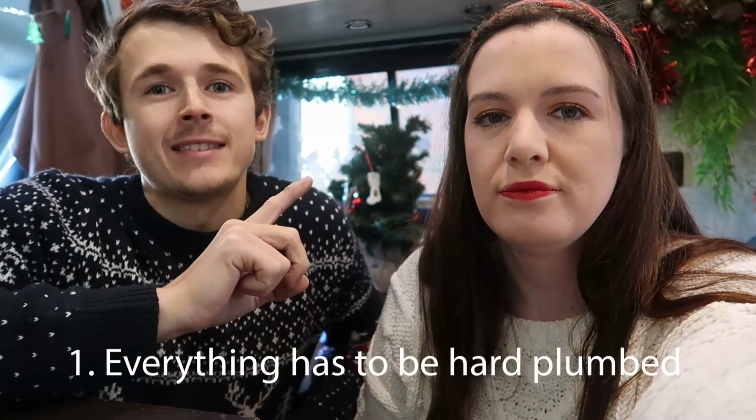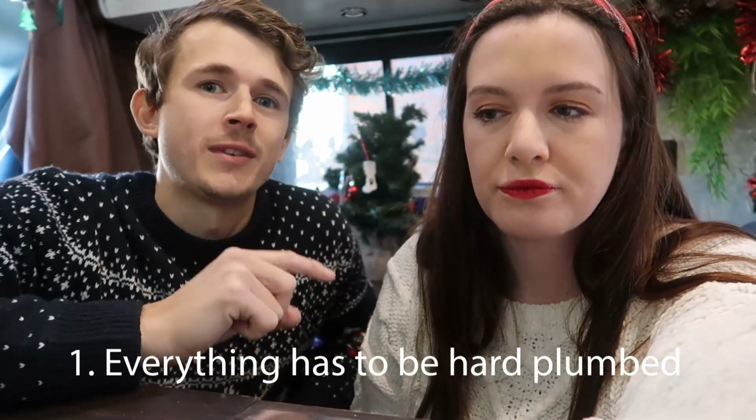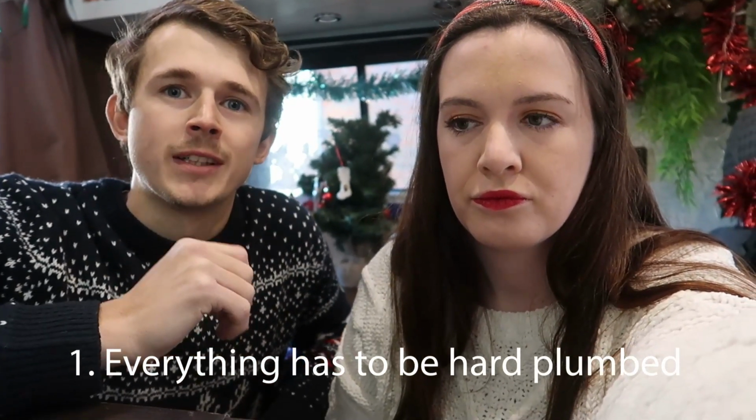Yeah, so number one is that everything has to be hard plumbed. So what that means is you can't use rubber hosing inside of a van. If you had like a gas barbecue outside, then you could connect a hose from the regulator to the oven, and that's fine. But inside of a van, everything has to be made of copper pipe.